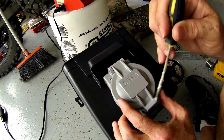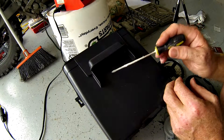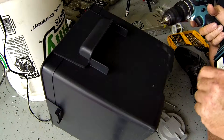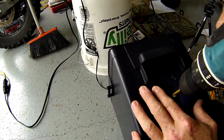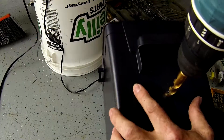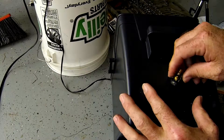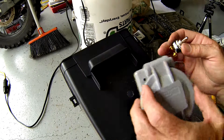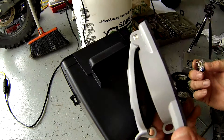The battery box tops have these little clips; I left those on and put RV sealant where the vent holes would be. It has big vents on the side, but I need to cut more vents somewhere to create airflow inside the box. I've already marked the hole positions using a straight edge — where the lines cross is the center. I need to drill here for my switch and put pilot holes for the screws. Now I just need to get this bigger hole in for the switch. It came out a little too big, but it will be fine. I'll mount my switch before putting the cover on since the nut is spring-loaded.